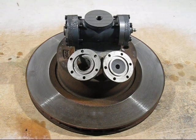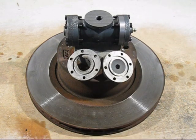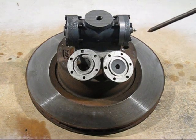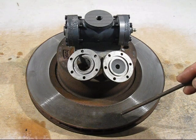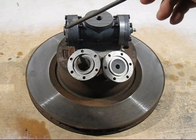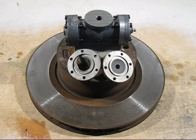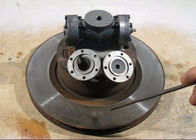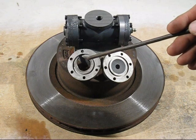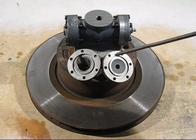With my gauge it's not much point going further. So we have this one here — why did this one break? Well, this one did not. I still don't know; obviously this one was weaker than this one, but it still broke. Anyway, with these disc brake rotors they are very high tensile strength when you recast them, which is why I used them for these two covers, and it worked extremely well. So I can recommend: if you're going to use cast iron for very high tensile strength, use disc brake rotors. This other cast iron here is a very soft cast iron — it went up to 450 bar before it broke. That's still a very high pressure, but if you want just that bit more pressure or tensile strength, you want to go over to disc brake rotors.